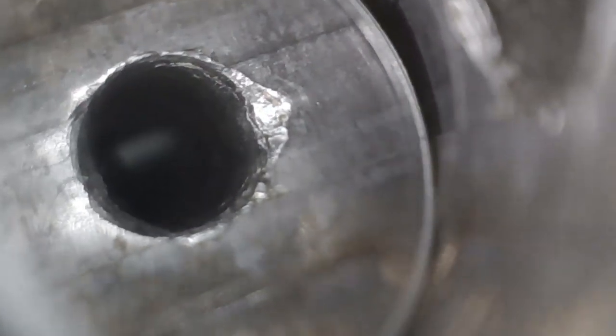I'm not too concerned about anything, but let's get on up here and take a look at some more areas. Let's go ahead and follow this land all the way down. That's the cool part about these 90 degree mirrors - you really can get in deep with these things and see what's going on. Let's give it a twist all the way around, nice and shiny, moving forward. Now we're going to run some rounds through this thing to fill in all those little crevices. I'm not too worried about the grooves, but the lands is where the bullet contacts - we want to smooth that out. There is the gas port, you can see it.